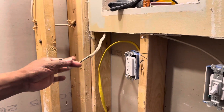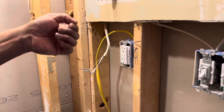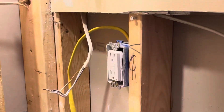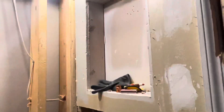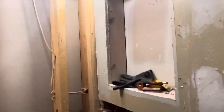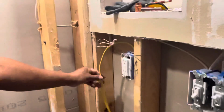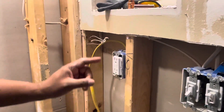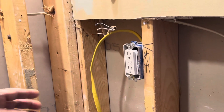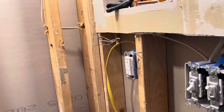It had no power whatsoever. I tested my electrical kit and everything — no power. I could take it all the way up and go into my ceiling wall, but I ain't feel like doing all that, so I'm just going to cap it, tuck it up in here. What I did was run new romex and put in a GFI, because this is a bathroom — the GFI shuts it off if water hits it, protects your life.